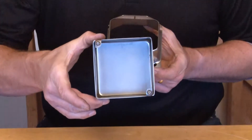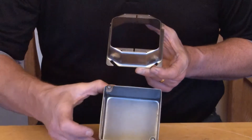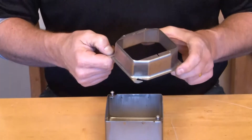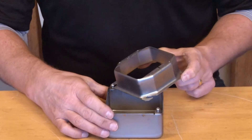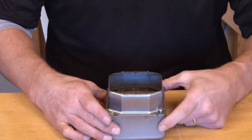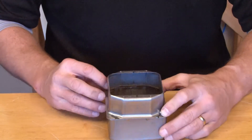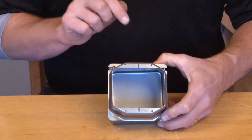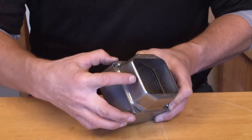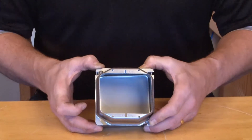Once you've installed your stainless steel Garvin electrical box and you need two device provisions, you simply slide the slot onto the first box screw, swing it into place, tighten down the box screws, and you now have a two-gang plaster ring ready for devices that is raised an inch and a half for the finished wall surface.